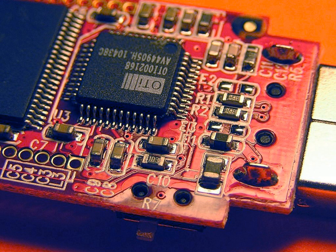Common in aviation electronics because of robustness to mechanical vibration. Micro-lead frame package MLP, MLF, with a 0.5 mm contact pitch, no leads, same as QFN. Power quad flat no lead PQFN, with exposed die pads for heatsinking. Topic: Grid arrays.